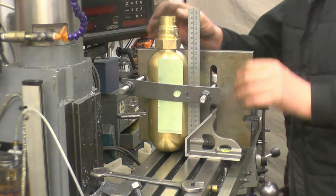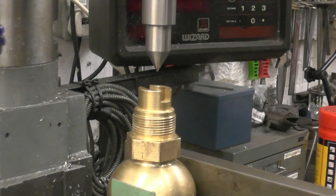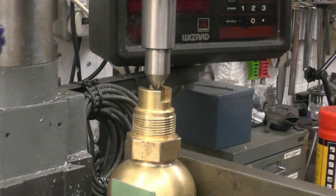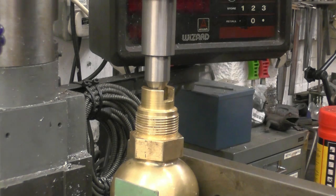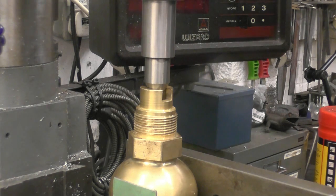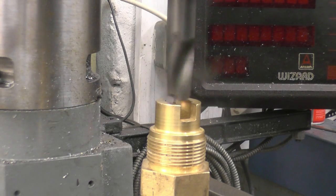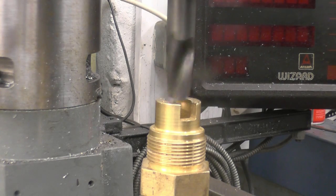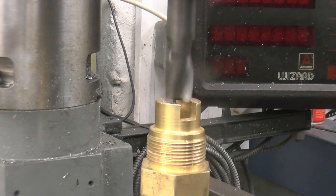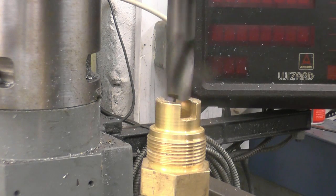It's pretty good there. I wonder if I'm complicating things lining this up. That looks good there. Put the cutter in and touch it off and make any final adjustments. I'm going to feed this in with the knee — obviously you don't want to feed it in with the quill in case it grabs and pulls through.